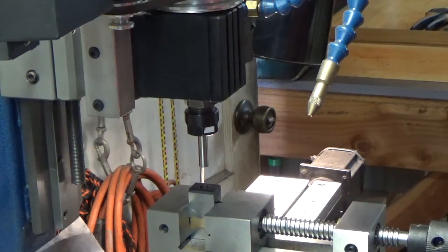I may spoil this piece, but I've got to go down about an inch, which is a long ways for a small end mill. I'm hesitant to use an eighth-inch end mill — that's what I'd normally use — because the flute distance is only about a half inch. I have some three-sixteenths end mills that are a little heftier, so the corner cutouts will be a little larger, but maybe that'll be fine.